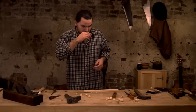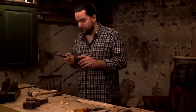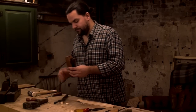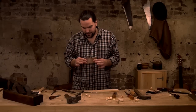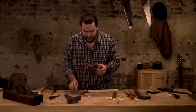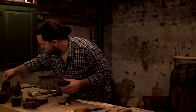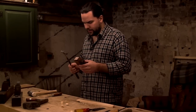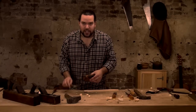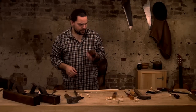I also use metal hammers to adjust metal planes, and I've seen older books suggest you shouldn't, but I've never had trouble. I tap the blade — no problem. It does burr over a little bit, you can tell you've hit it with a metal hammer, but there's so much more feedback with iron than with wood. Regards to the wedge, you don't damage it if it fits well because you're not having to hit it hard — you just tap it.